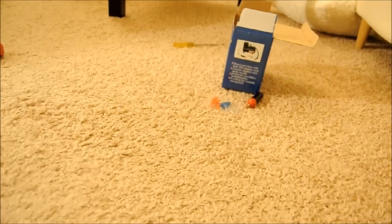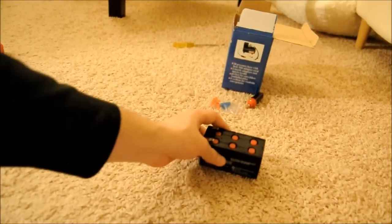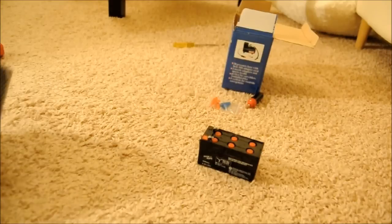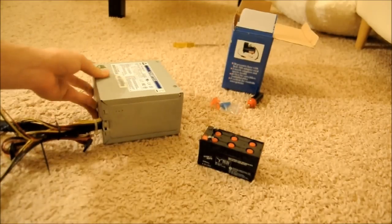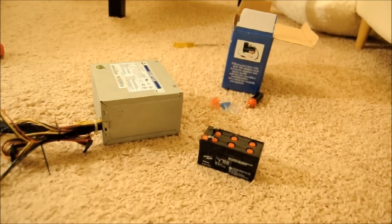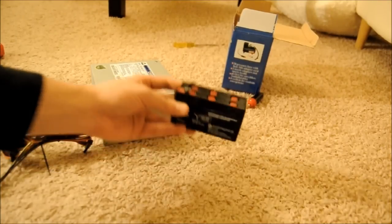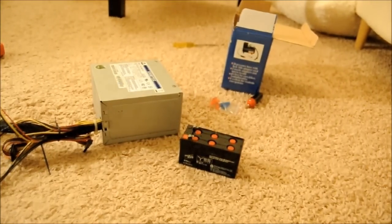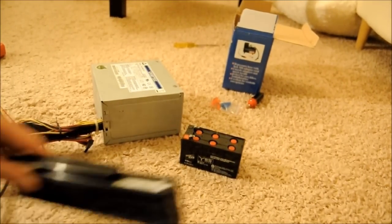You can power this with battery power as well as with an ATX power supply. For input you will need something between 9 volts and 14.4 volts, capable of giving 5 amperes average. The no-load current is about 3.5 amperes. For battery power, I suggest that you use a minimum 2 to 5 amp 12-volt lead-acid battery.